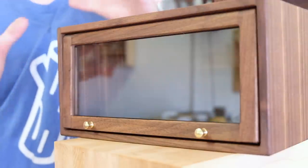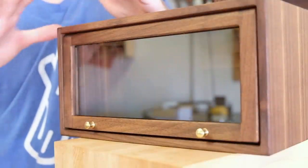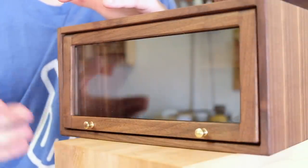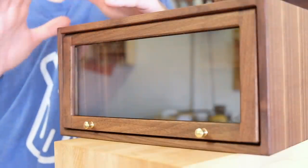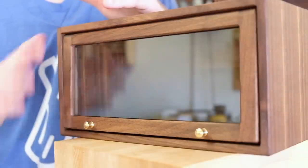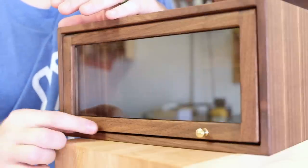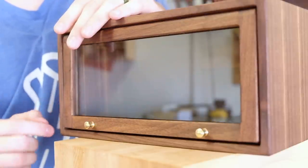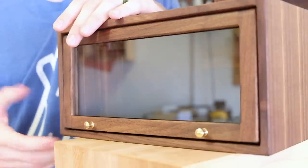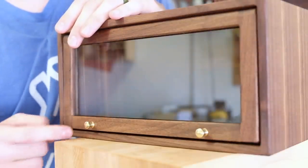Back to the topic of scale and proportion — I had to find hardware, in this case brass knobs, that kept within that scale. These are solid brass knobs from Kennedy Hardware — not sponsored, but I'll leave a link below. These were the best knobs I could find online at the right price. You can spend a lot of money on brass hardware, but I needed 12 of these and they were only $1.15 each, so after shipping this was less than a $20 order. I did have to get new screws because these doors are only a half-inch thick, and the included screws were meant for three-quarter or five-eighths-inch material — but that was a quick, easy fix.